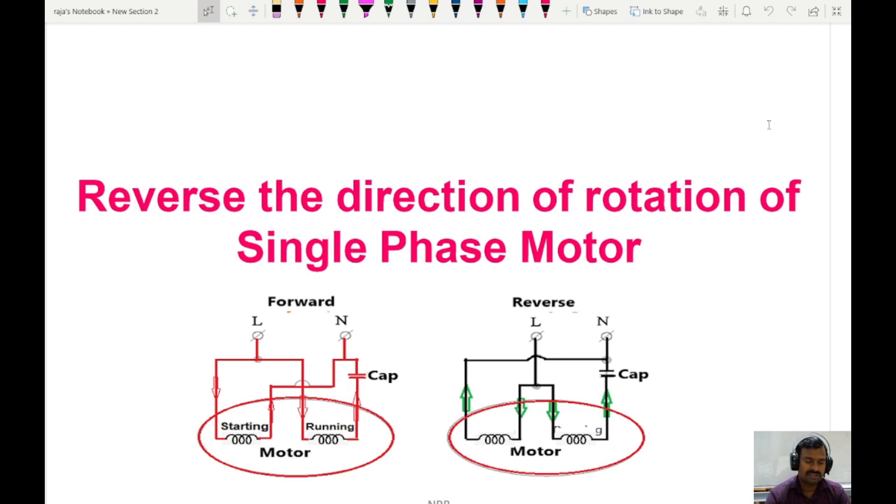In the picture you can see that a single phase induction motor has a start coil, a running coil, and a capacitor. The starting coil is connected to the motor only during the starting period if you have a low torque requirement. If more torque is needed, the starting coil is connected permanently. The purpose of the capacitor is to split the single phase into two phases with a 90 degree phase shift, producing a rotating magnetic field, which is what generates the torque.